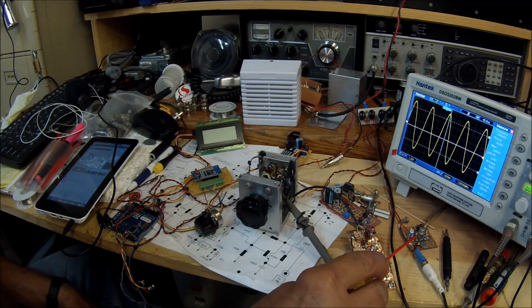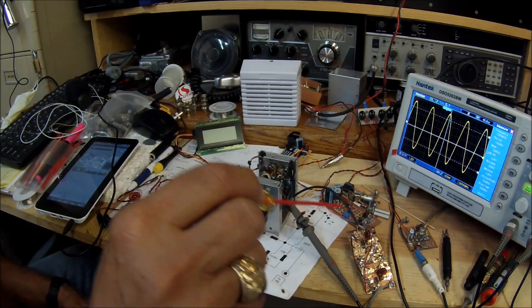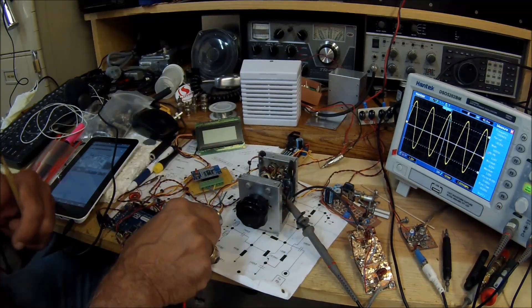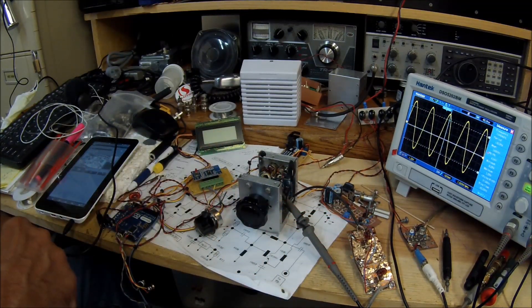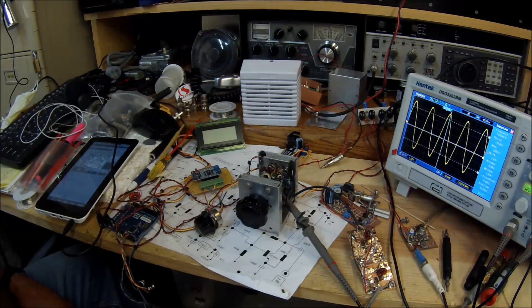This RF amp is pretty healthy — about 10 dB gain. Although we find that if you operate it full out at 10 dB, the problem is that you overload the balanced mixer. So we are kind of surprised that with such few components you can have a very workable receiver. The VFO is relatively stable, so this would make a nice first receiver.